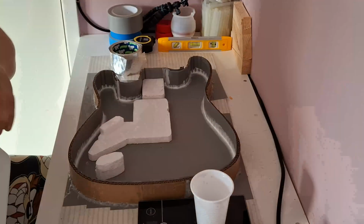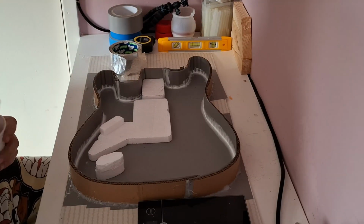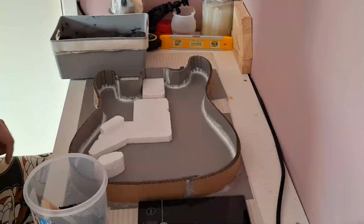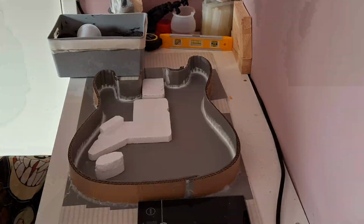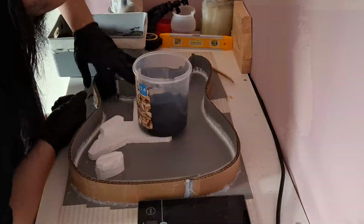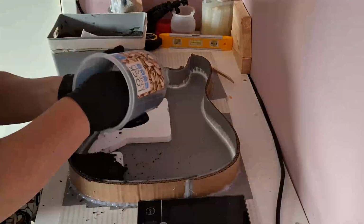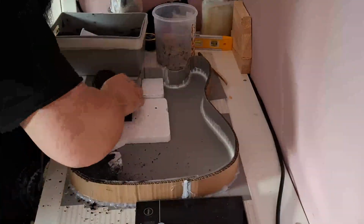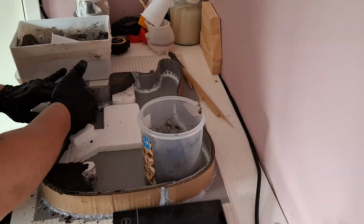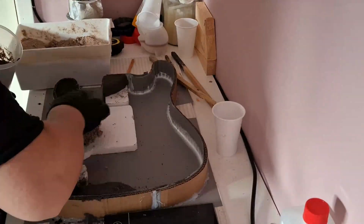So I figured I would save you all me waffling and just get straight to it. Initially I mixed up 120ml of resin, which is about a millionth of a football field for my American friends. Then I put it in the cup, realised it was about half a cup's worth of resin, and thought, well, go for the old cement ratio, 5:1, 2.5 cups of sand. Straight off the bat it seemed to work. It was just sticky enough that it would hold together, but not so much that it was sloppy and started sliding everywhere, so that was really good.